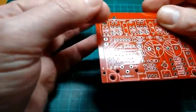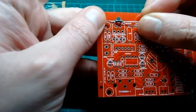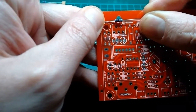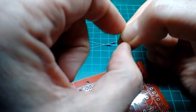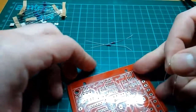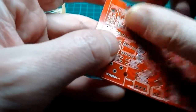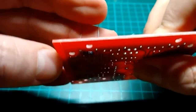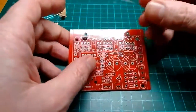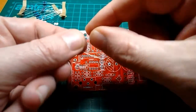Now you want to bend the lead so it goes in the hole. It's worth holding it up against the hole to get a gauge of how much you have to bend it. I've seen some people hold the resistor in the middle and then bend the legs down like that, and then put it in. I'm going to do that — and in that case it works pretty well. On boards where the pitch is a lot smaller it can sometimes be advantageous to bend them individually to get a narrower bend.